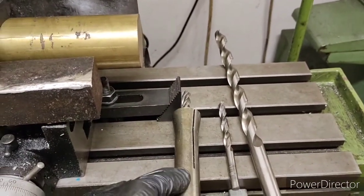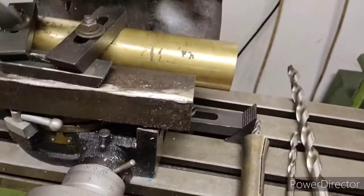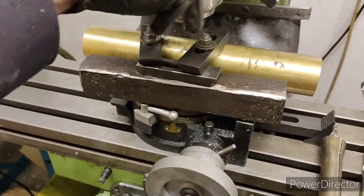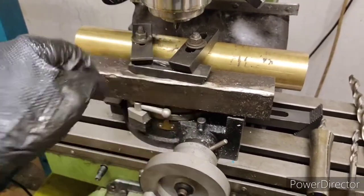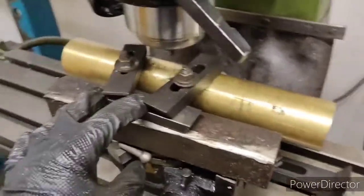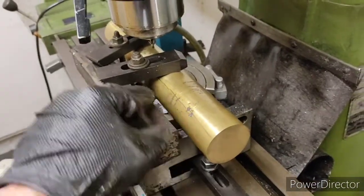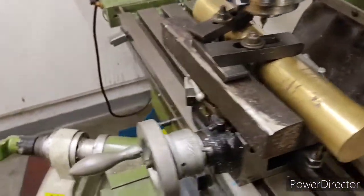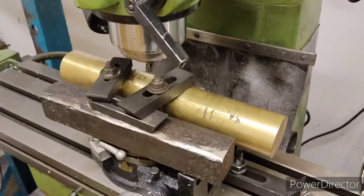Then I'm going to take the milling bit — I think it's an 11mm — and I'm going to use the rotary table to physically turn out my hole. When I've made the hole, I'm going to go to the outside to turn a bigger mount round the outside. It's a little bit unorthodox how to hold it but that seems to be the best way of gripping this. I've put some blue paper underneath so this is going to take a bite on the rotary table.